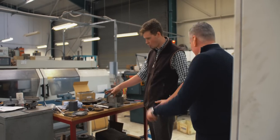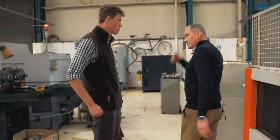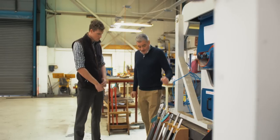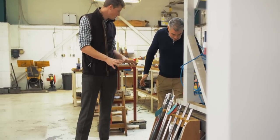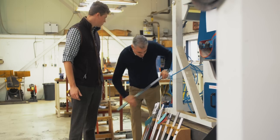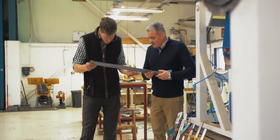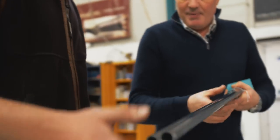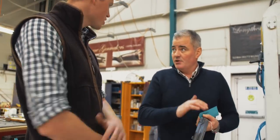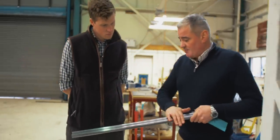So we've got all the bits — what happens next? Once you've got the barrels and the bits, we take them down this end to have them polished by hand. The barrels come down from the manufacturing end at that side as a raw machined thing. We'll finish them down to about 240 grit finish — taking all the machining marks off, any scratches. And then at that point we send them to proof. We get no rejections anymore. Everything's proofed.